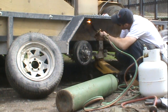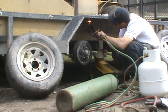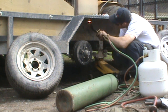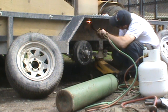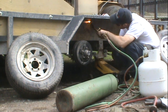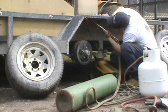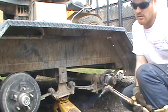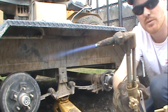I've marked it out already where I'm going to cut. I find with propane you don't get really good heat out of it — it just kind of melts. So you want to heat it up until it's about cherry hot, and then you add the excess oxygen. You can see those nice cones there.